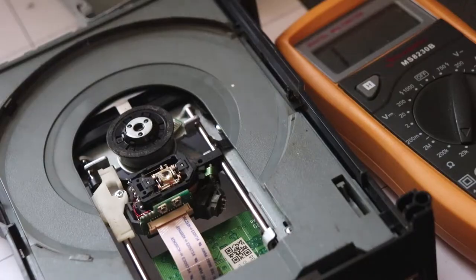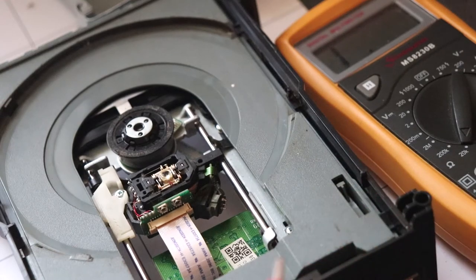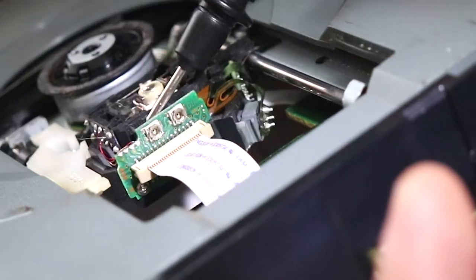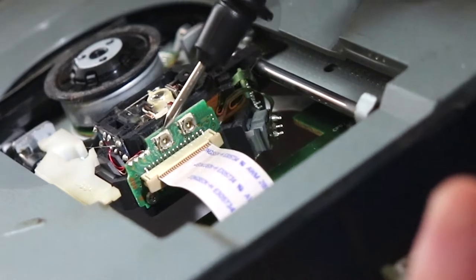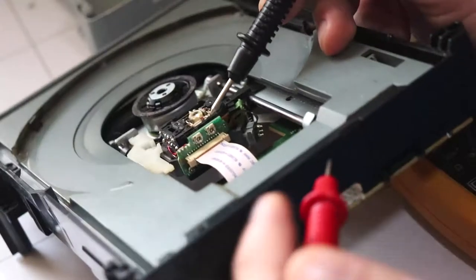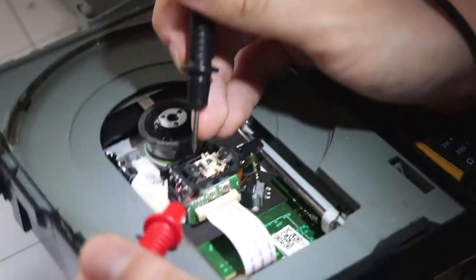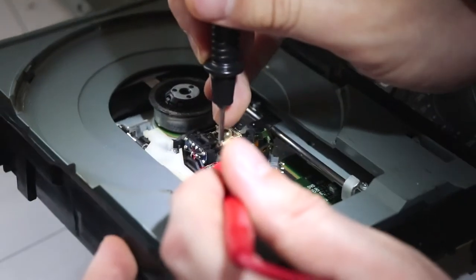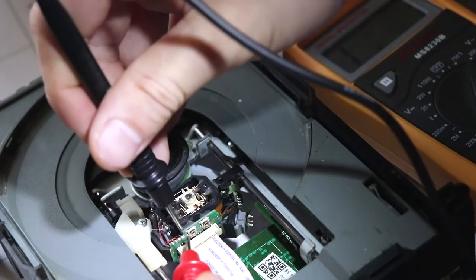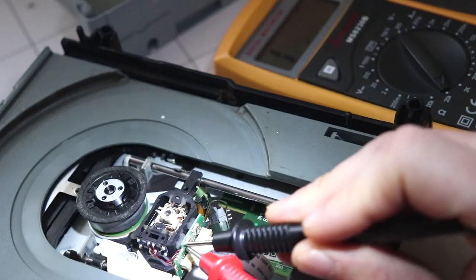Get your two little prongs on the multimeter. You'll see two little screw heads here — the left side is your DVD game reader side and the right is the CD side, but we want to focus on the DVD. Get your two prongs and touch the two little soldering joints on the left side. It's quite hard to get the exact pinpoint.